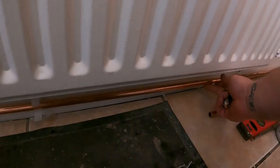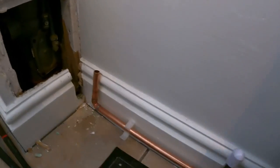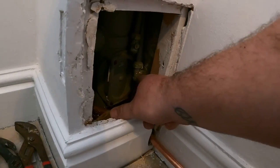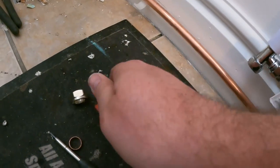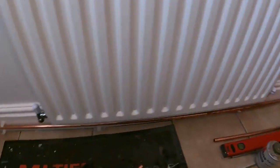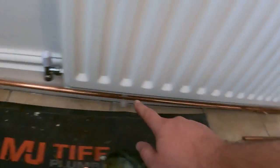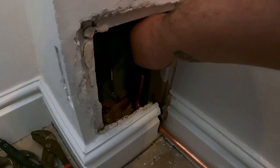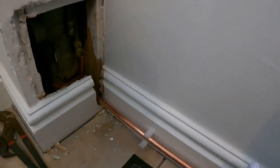I've got the clips running along the bottom now. I've just put a little bit of 15mm there — soldered the elbow onto the end so we can push that in and it will go onto the bottom of that isolation valve. I'm going to nick a nut and olive off that iso. I've got hundreds of them stuck in my fittings tubs that I've nicked nuts and olives off. So we'll get that one done and then get the other one done. That one is going to go and pick up the TRV at that end. We'll put another one running along the top, elbow up into the other isolation valve, get them tight, and then connect the rad up.